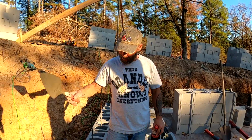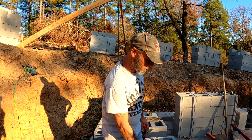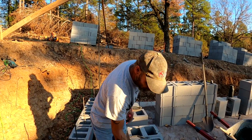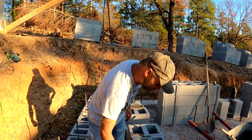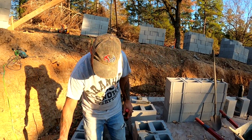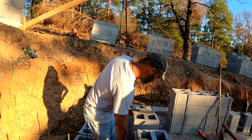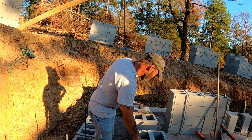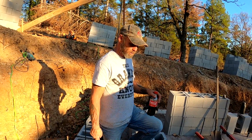If you trowel it on, it's a lot easier to lay. So less sand. A lot less sand. And the water content is probably fine if we just did less sand? Yep. Or more mortar. One or the other, you gotta have less sand or more mortar in what you guys are doing. That's just too sandy.